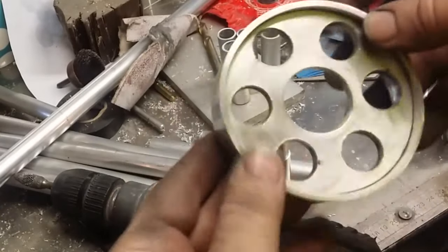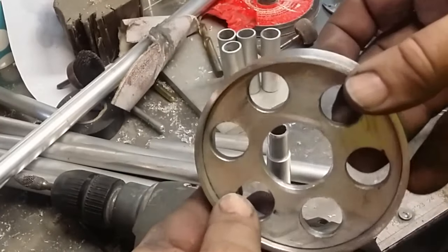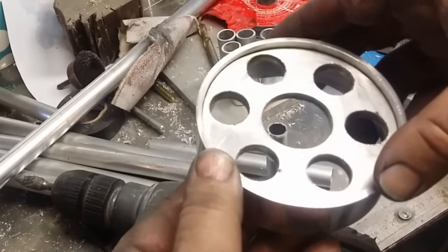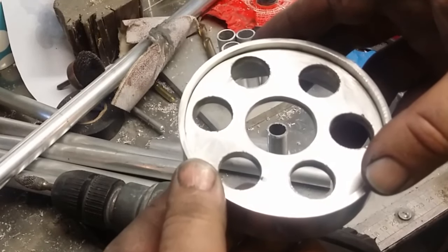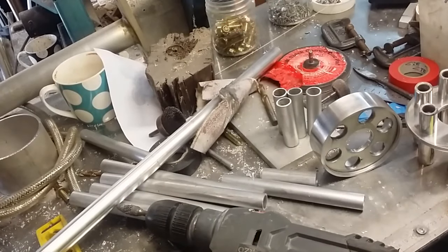and that's because I've been able to make this part up to such a neat fit that it jams inside that outer tube so tightly that it becomes a solid piece. And because there's going to be no mechanical stresses on the part, that's going to be more than enough tension in there to hold together when it comes to the full assembly of it. I've continued that theme across into how I'm assembling the barrel pieces.